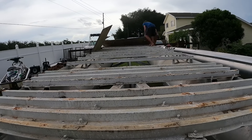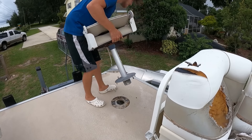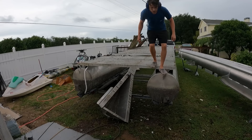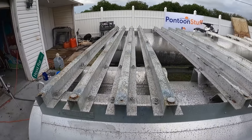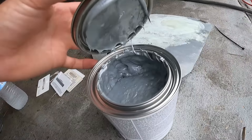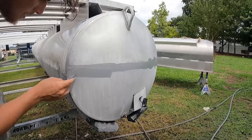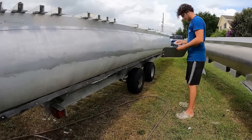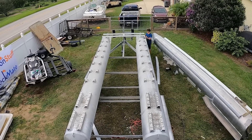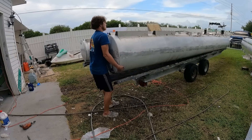The pontoons and framing on this thing were in pretty good shape. I ended up replacing all the hardware because it was a little corroded — this boat was by the ocean and I'm sure it was in the ocean for most of its life. The pontoons didn't leak and they all had air. I took the transom off because I don't need it anymore with the center pontoon. Cleaned up the pontoons, there was a little bit of shells and algae, and I ended up filling in all the little corrosion spots with some All-Metal filler — about $20-40 bucks. Sanded it down and painted the sides so it all looks uniform. The outsides of the pontoons were dented, so someone had the idea of swapping them so the non-dented sides were on the outside, and it looks a lot better. I had to take off the bracing anyway to replace all the hardware, so that was easy going. I was able to do all this myself.